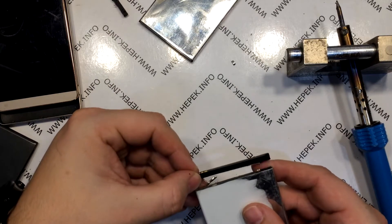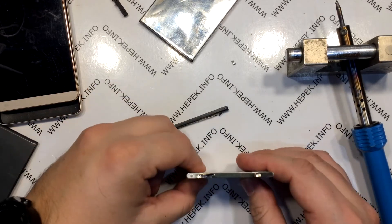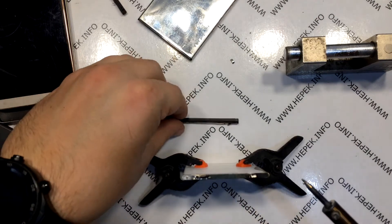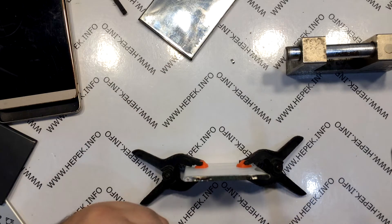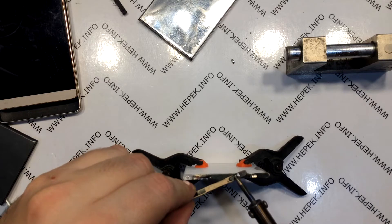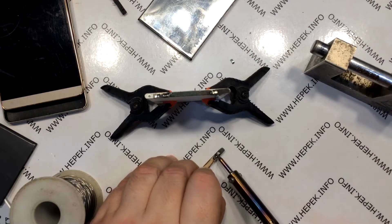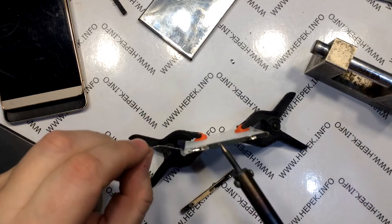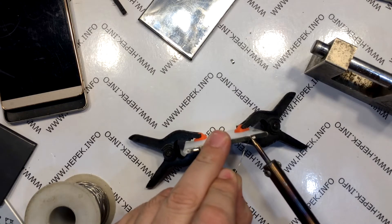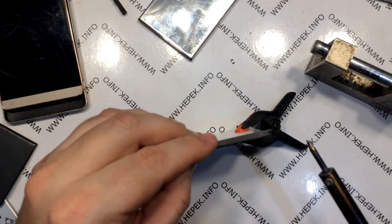I take the new battery, measure the position of the contacts once more, and position it so that the positive terminal exiting the cell is on the same side as the positive terminal on the electronics of the battery contained in the plastic. Then I use plastic clamps to hold the battery upright. I carefully put some tin on the negative terminal on the battery cell. It is necessary to pay attention for the tin to be soldered exclusively to the negative terminal, without it reaching the cell envelope — which, as we have established, is also the positive terminal. I also apply tin to the negative terminal on the battery electronics, then rotate the electronics and apply tin to the positive terminal of the electronics as well. With tweezers I adjust the position of the positive terminal on the battery cell, then apply tin to the positive terminal of the cell as well, and add more tin to the negative terminal just in case. I put the electronics in position so that the negative terminal on the electronics and the negative terminal of the cell align and touch exactly where the tin is.